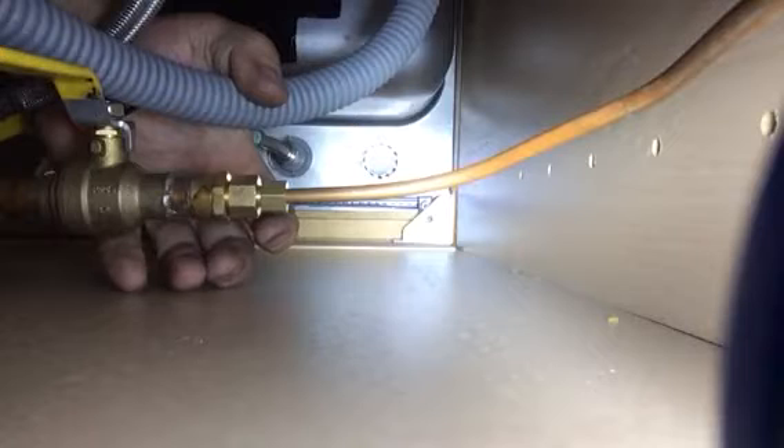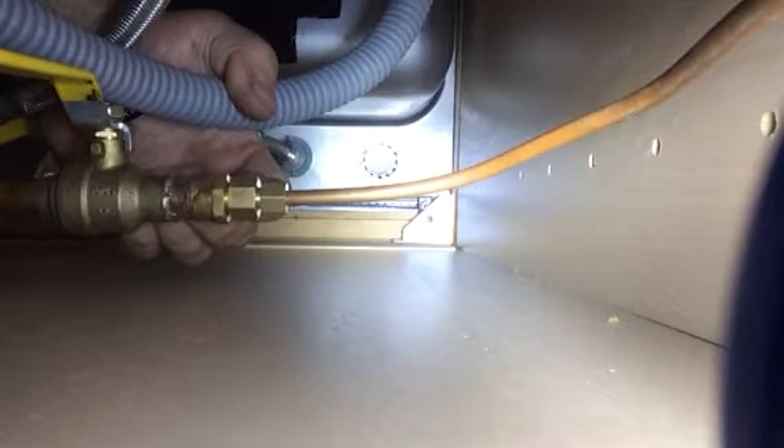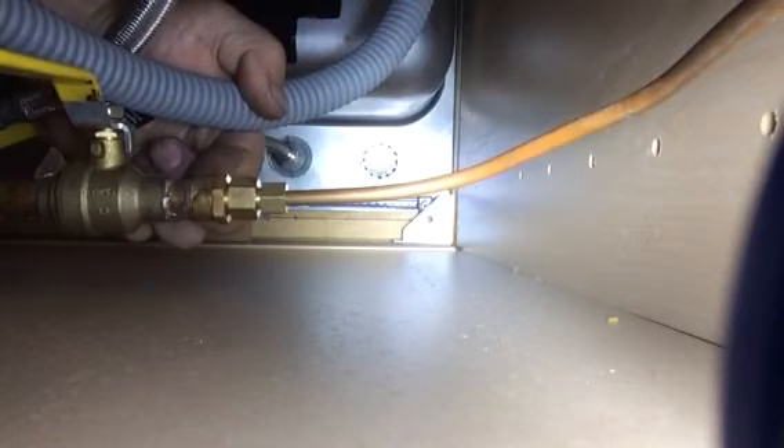I'm at the point now where I'm going to finish up my installation and turn that on and see how we do. If it leaks a little bit I'll tighten it up. I just wanted to make you aware of that fitting — the 3/8 to 1/4-inch compression fitting. You don't have to go from 3/8-inch tubing to the quarter-inch pipe directly — you have your 3/8-inch compression fitting to sweat and then that adapter piece. I just want to make you aware that that's available.